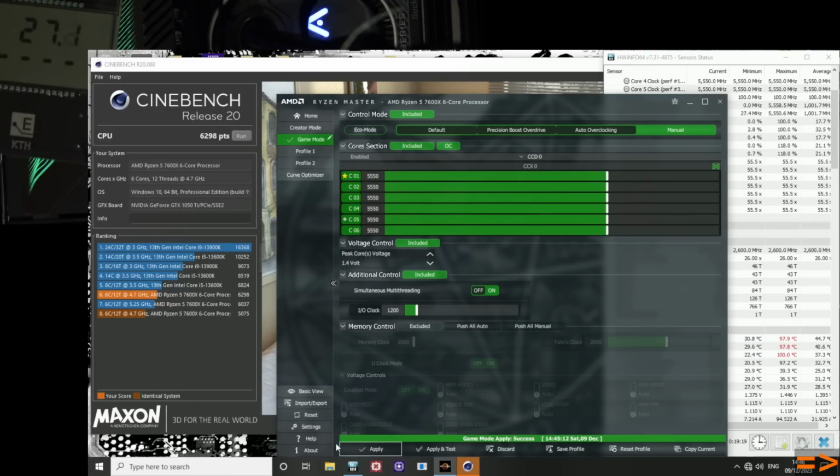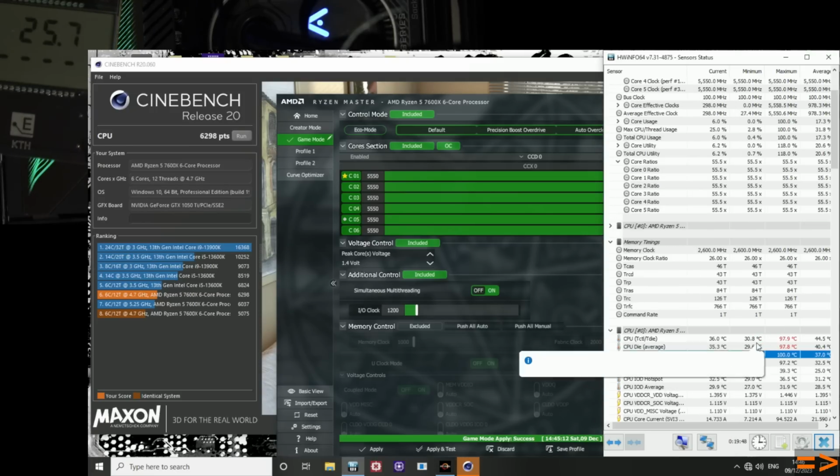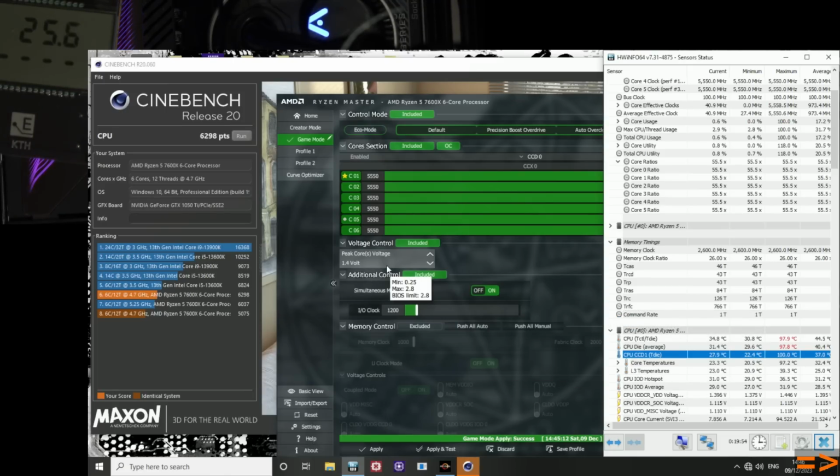So in the past, this wasn't really an effect that you would necessarily have to worry about, because on old CPUs with big transistors, you didn't have really nasty small hotspots, right? Because that's the whole issue here: the chip density keeps getting higher and higher. Transistors are getting smaller and smaller, so now your hotspot is way smaller than it used to be, and it can be a lot hotter than it used to be. And even in the temperature readings that you might see in your monitoring software, it might not look that bad, but you could already be well past the point of negative voltage scaling, where any more voltage just causes worse overclocking performance rather than better.